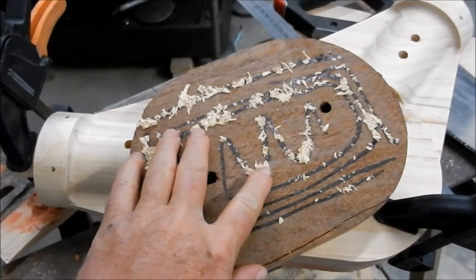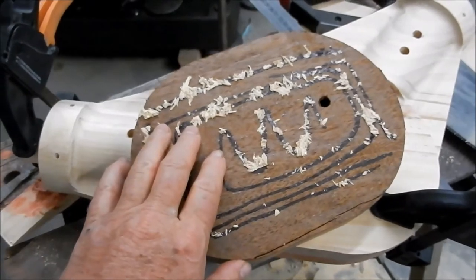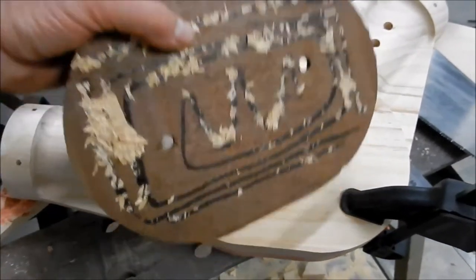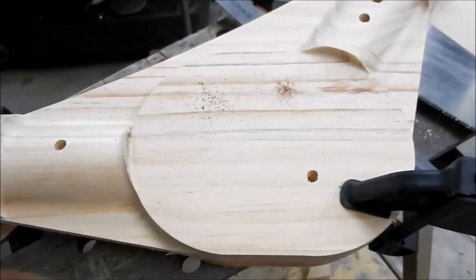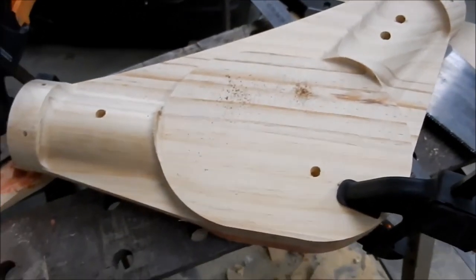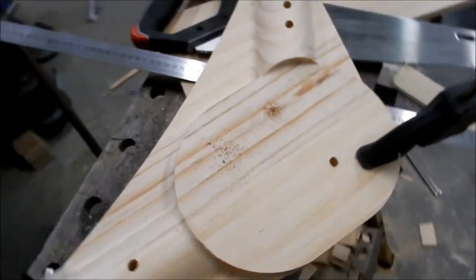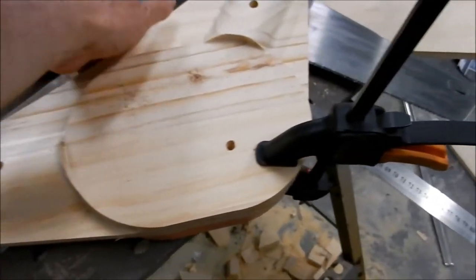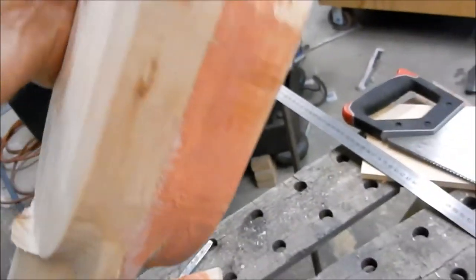All right, just a couple of hard blows with a hammer on a block of softwood, and as you can see, we'll release it from the waste board. So that's it completed, the muffin top for this part of the pattern. And what I've done is I've actually clamped the two halves together to stop them from warping, and we leave that like that until we're ready to start painting. So you can see that, a bit hard to hold, but it's a perfect match.